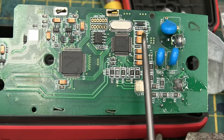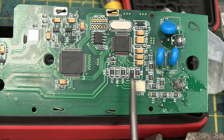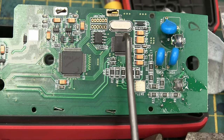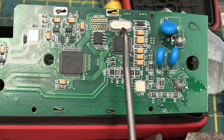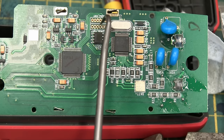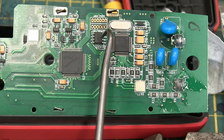We have the tantalum caps here, a little post for the battery — just wiper contacts, no real positive connection to the battery, so that might give you troubles later. Here's some sort of driver for the OLED — I can't find the number, it's an H201 DTA0661. And a little tip — I'll do a tip video and put it in there. This is just EEPROM, so just memory — a jellybean part probably. It's a T24C02A.